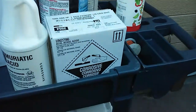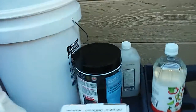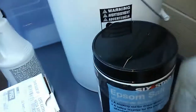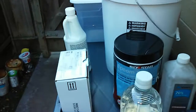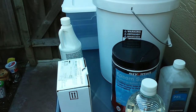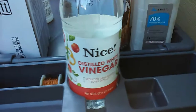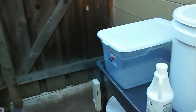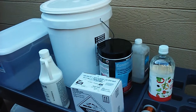Sulfuric acid, which is battery acid, you can buy at AutoZone or O'Reilly's. All this stuff was easy to get — Epsom salt I got from Walgreens. Isopropyl alcohol is also good to have for cleaning. The only thing that was tough to get and I had to order was the third chemical for the plating solution. The three chemicals for the plating solution are Epsom salt, white vinegar, and zinc sulfate. I ordered two pounds on eBay for about five bucks and it'll be here today.